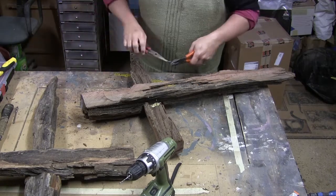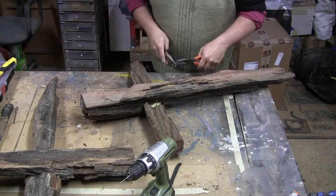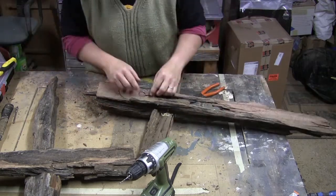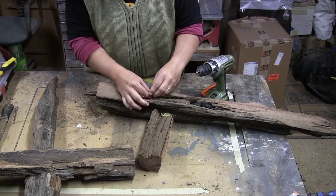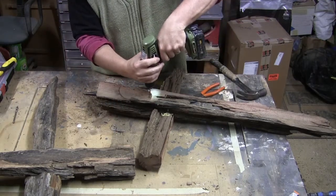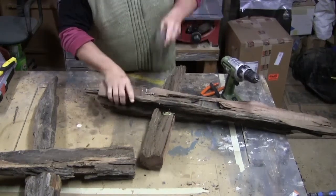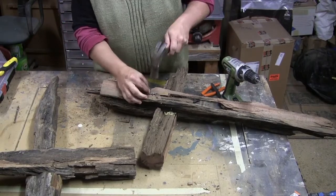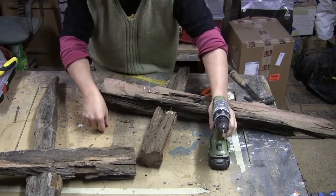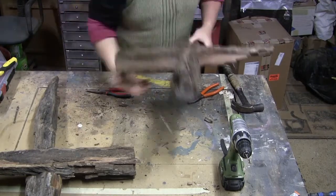Went and got some horseshoe nails, as we've got them in Australia, that you use for barbed wire when you nail a wire to a fence. Tried banging it in and it bent, so went and got some more and banged them into place and then pre-drilled the holes. The drill hole is smaller than the nail, so it's still nailed in, and I put one in to hold the wire and then one through the loop, so above and below the loop, so nothing's going to pull out. Thought about gluing them, but really and truly once I banged them in it was solid.